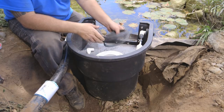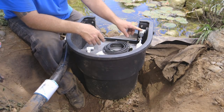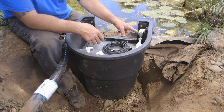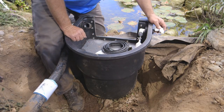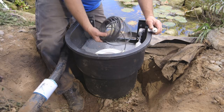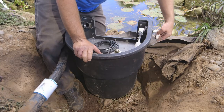The autofill we're installing today is gonna connect to a hose bib — that's how this one was already set up. You'll see the autofill valve is already in. We have Teflon tape on this piece and this piece. I have another little fitting that we're gonna screw on the outside here, and this is our quick disconnect for our quarter-inch tubing. I'm just gonna go ahead and get this installed.